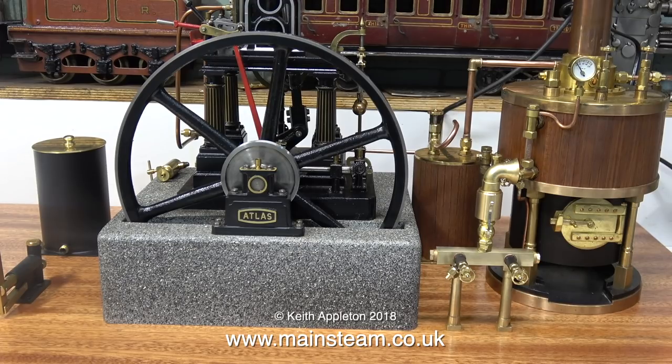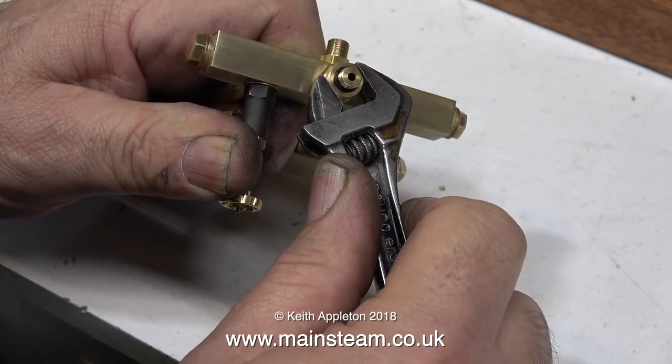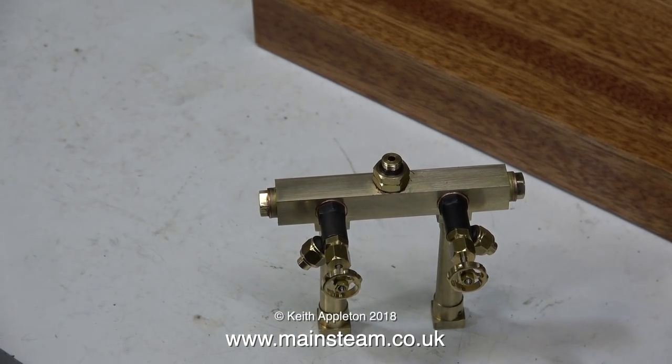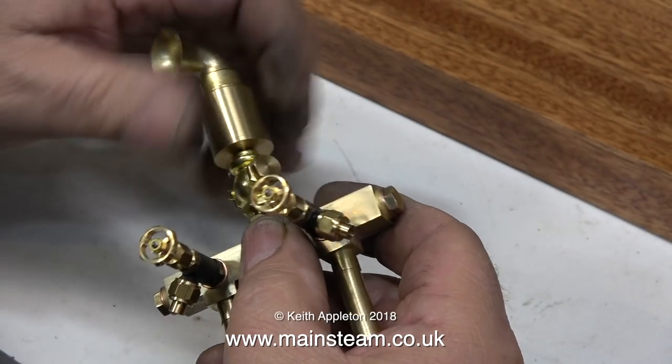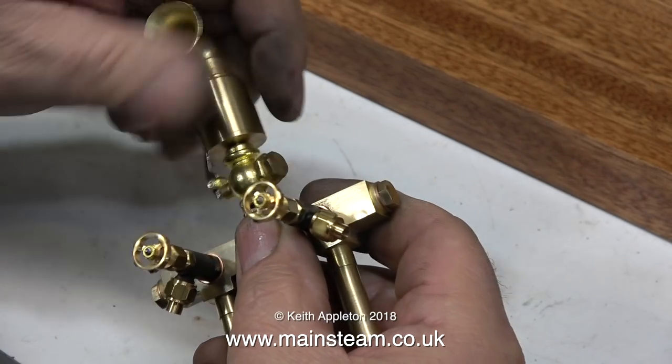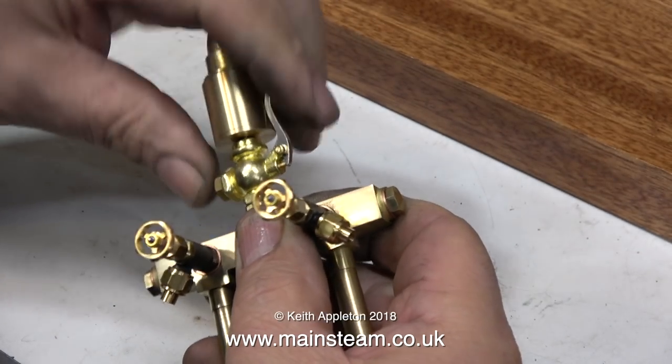Here's work in progress so far, and I think it's going to look really good. The siren and the turret match the brass work on the boiler. I removed the siren fitting and applied some Loctite 542 where it goes into the turret. The fitting has an O-ring at the top, so I don't need to put any 542 on the top thread. So that's the turret out of the way.